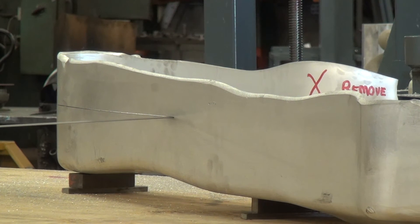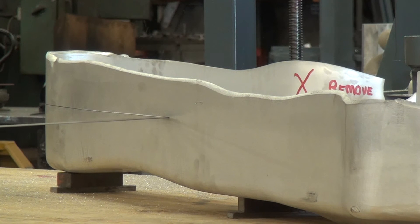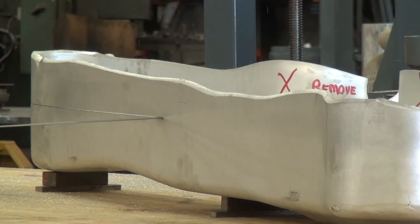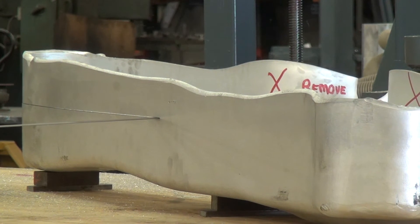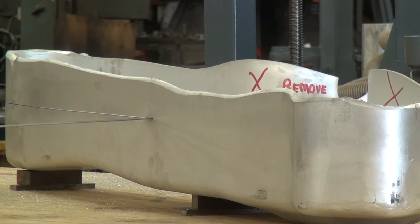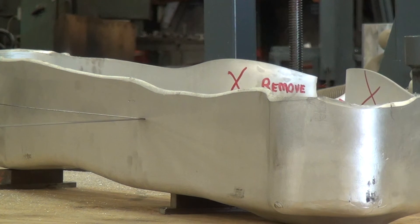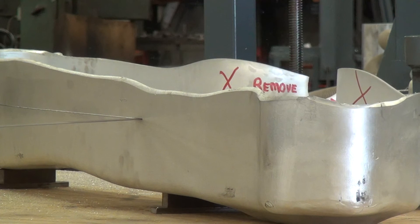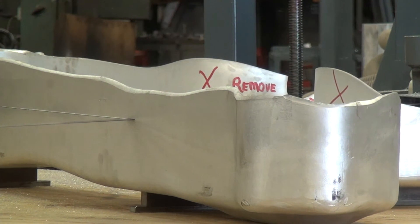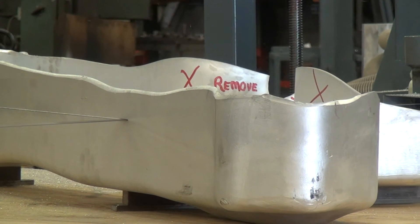When we're not pushing the blade very hard into the rear blade guide wheels, we can give it a little more. The cable drive mechanism uses an inverter drive. I'm running at five hertz, which is one-twelfth of the full speed. The full speed is two inches per second, so whatever one-twelfth of two inches per second is, that's how fast we're advancing the work feed. You can't see this from the camera, but the entire shop is standing around watching this.